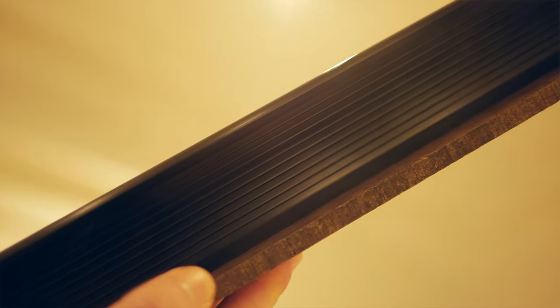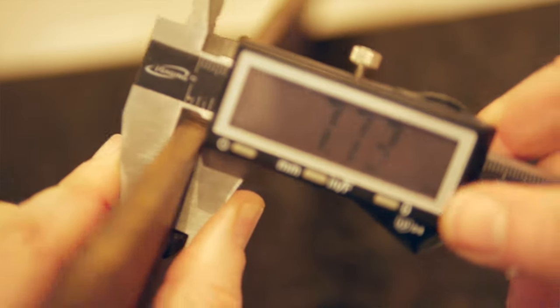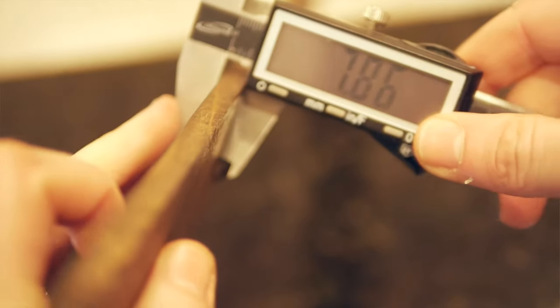The piece of laburnum I'm using for the fretboard was not supplied as a handy square and flat piece, but rather it already had a rough taper and also had a little knot right on the edge. Many people pre-cut the slots to receive frets and shape the fretboard to the neck taper before gluing it in place to the neck, but as my fretboard piece was already in an awkward shape, I've decided to glue it to the neck first, whilst using the taper of the neck as a router guide to trim the fretboard to shape. I will also cut the fret slots once the fretboard is glued onto the neck.